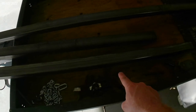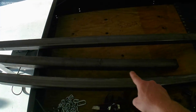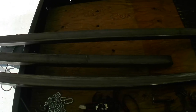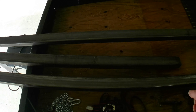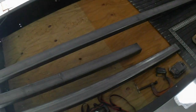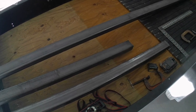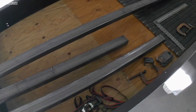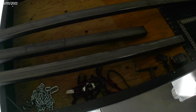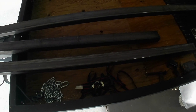Here is the first rock slider. That middle piece is how much leftover I have from that first 10-foot bar. I can get five support rails out of that one piece in total, which means I needed about 16 or 17 feet total. So if you're planning on something like this yourself, you could use that calculation. I'm going to start getting the brackets cut for this first one and get it finished up.